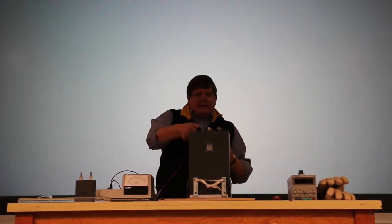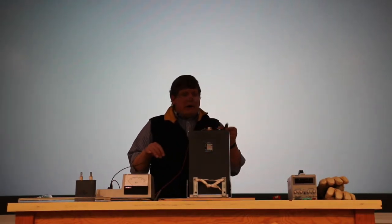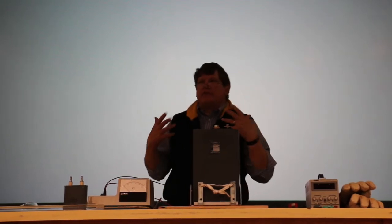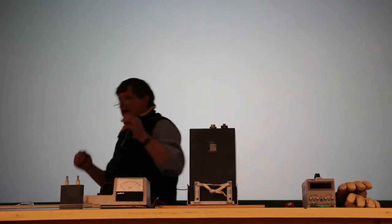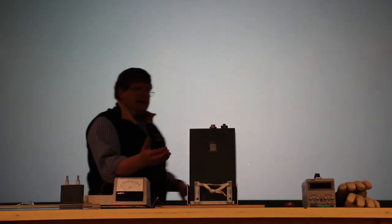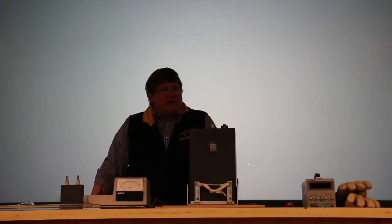Should I be covering my ears right now? It's not going to go off for a while, so you're going to be fine. Actually, last period, it was very disappointing. We came in and we found there was a bunch of oil leaking out of this one here, and the boom that we had was about half as loud as it normally was. I suspect that someone, last time they used it, may have damaged this capacitor here, and so instead of two in parallel, we just have one in parallel.